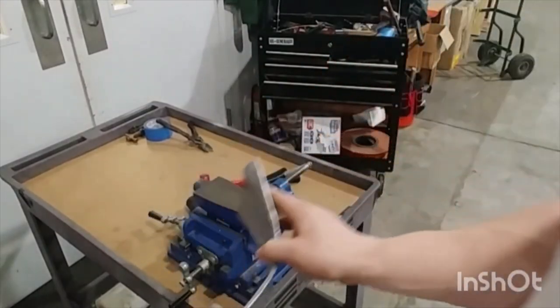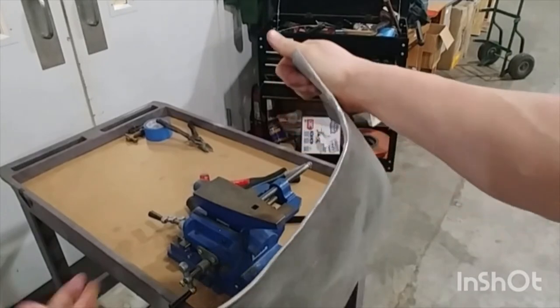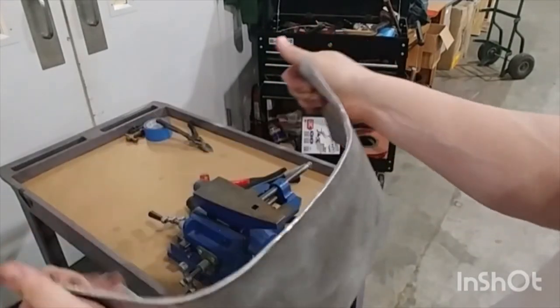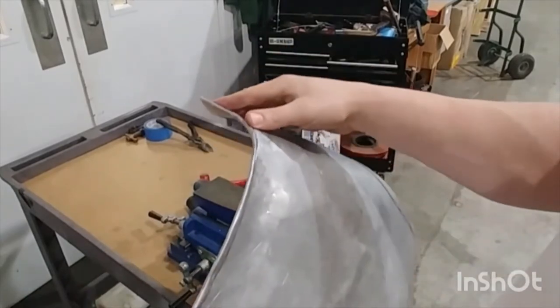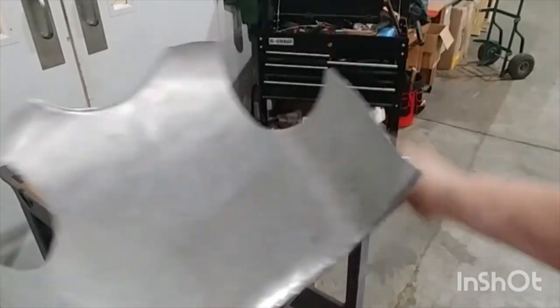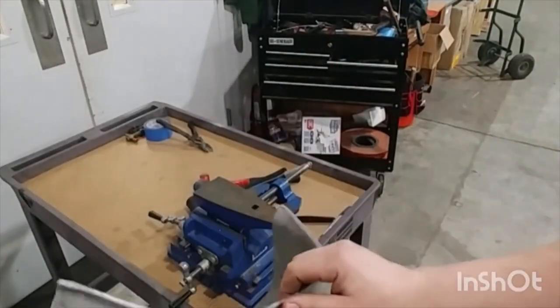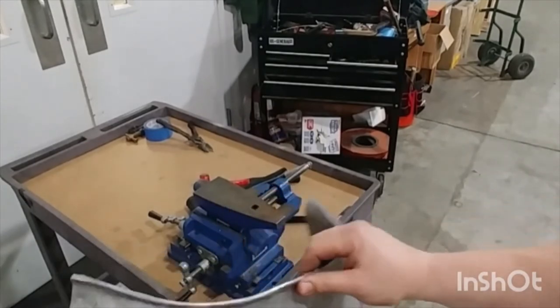Always check your shapes. Even now, it's not too late to try to make a correction to bend them back where you want them. But the same way we sealed the edges by hammering most sides flat, rolling an edge is going to give it a lot of strength, for better or worse. If you've got a bad shape that you roll, it's going to be very tough to keep it from staying a bad shape forever. So try to make sure your shapes are good before you start to roll them.